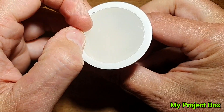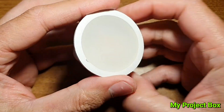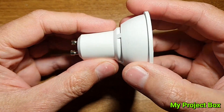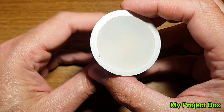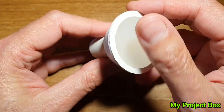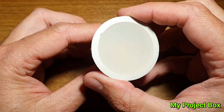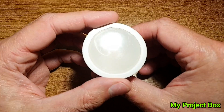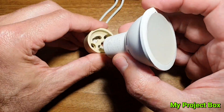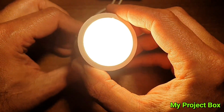A really simple hack that Big Clive came up with — just snapping a resistor off a board can make a cheap one-pound light bulb last much much longer. Let's pop the diffuser back on. If you can't get hold of the 3 watt ones, which I recommend you buy, you can always get the 5 watt ones and just clip that resistor off. Let's light it up with the diffuser on to see what it looks like — yeah, that looks pretty good.